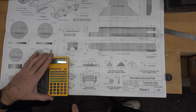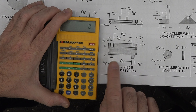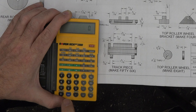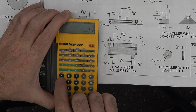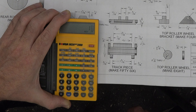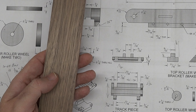I've milled a bunch of 3/16-inch stock. The first thing to do is rip it to the width of these tracks, with the grain going lengthwise. I added up the measurements across the board: 1/8 inch, plus 7/32 for the gap, plus 1 inch and 9/32, plus another 7/32, plus a symmetrical 1/8 inch — and you get 1 and 31/32 inches. I double and triple checked it.